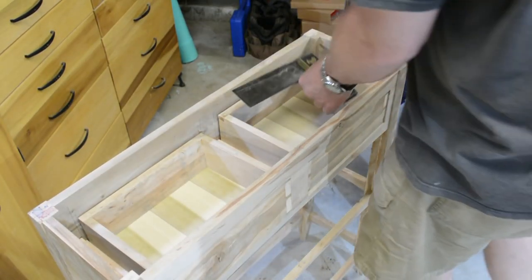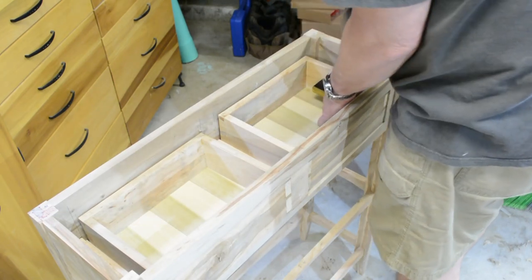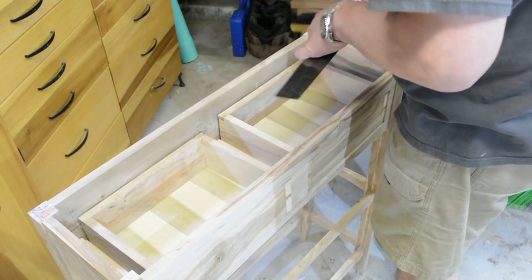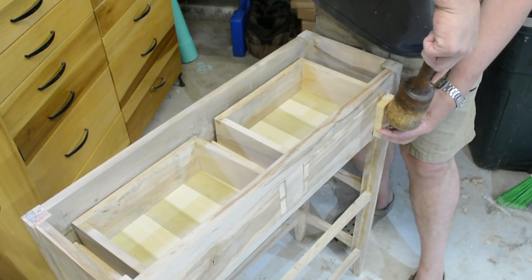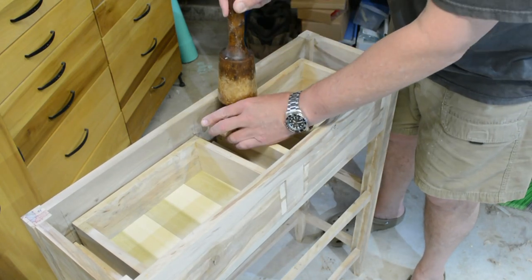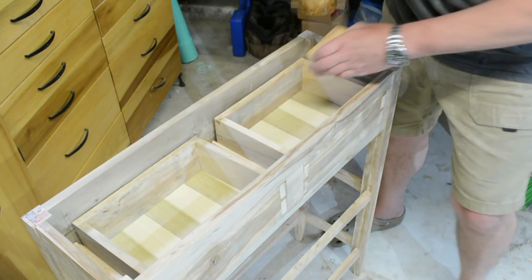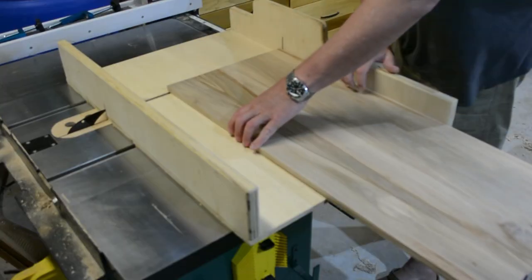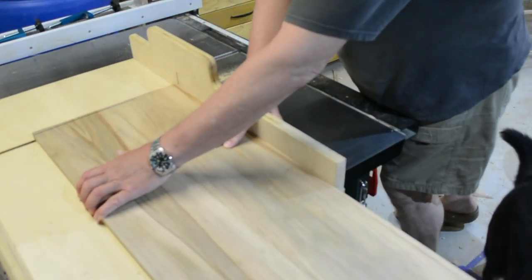I like to put drawers in while the glue is still wet, so I can nudge the drawer to fit in its final home if needed, but I also check square to be sure I'm not doing anything funny. And since this will be a flush fit drawer, I'm taking advantage of it while the glue can still be moved around to work on the alignment of the drawer directly to the front. With the carcass glued up, we can go ahead and final cut the shelves and the top.